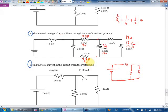How's that help? Well, look, look. If we start here and end here, if we go through these three hills, how many volts do we lose? Is it 36? That must mean if I go through this one hill, I also better lose 36 because we're leaving and meeting together. The skiers can go this way or this way. This has to be 36 volts. Ooh. Which tells me what the current is in this particular resistor. 36 divided by 5,